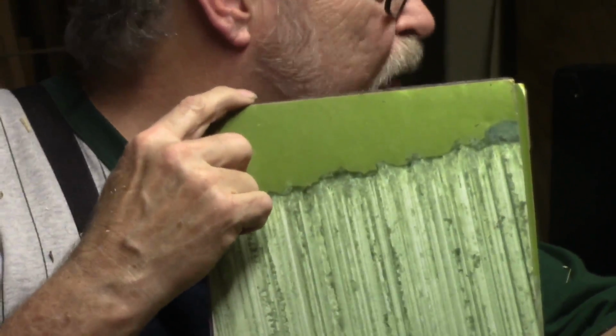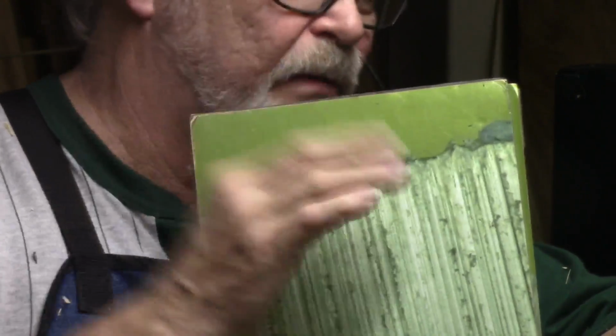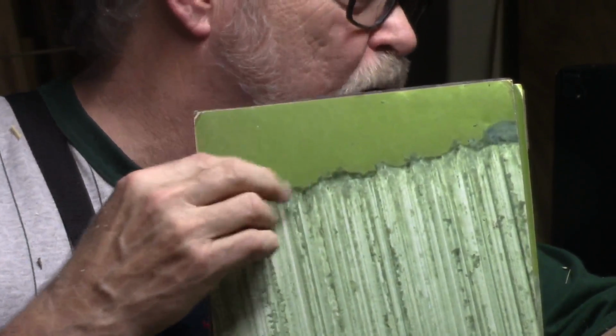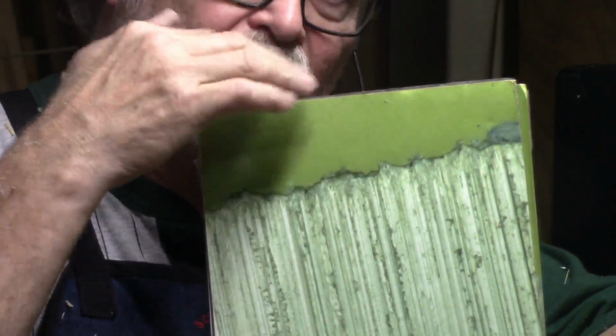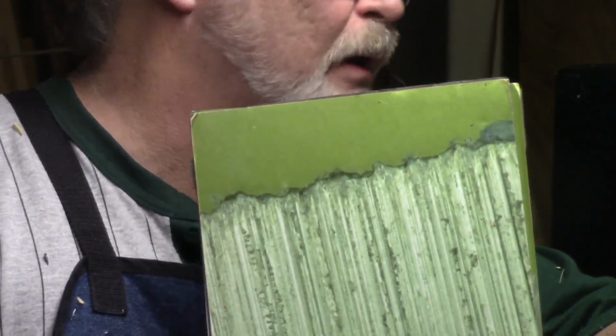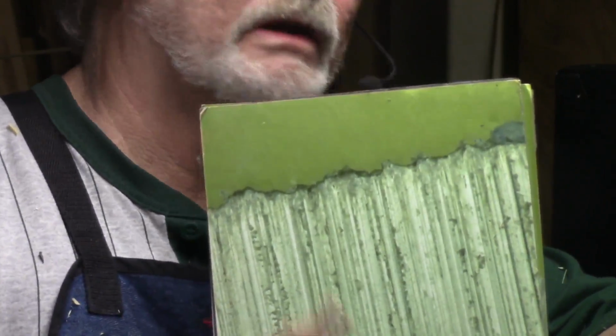It's not going to be smooth. It's like a little tomato knife. If you're roughing, who cares? No, it's okay for roughing, but I'm talking about if you were down into finishing land, trying to do better. What about its durability? It's going to break out there at a very minor level, but it ain't going to break off sharper. I mean, it's going to dull quicker.